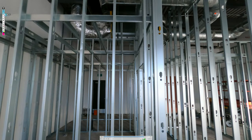So ceiling work is pretty standard. We're shooting our line laser and we're marking our elevations. We're putting our track. It's just like building a wall on its side. And I put two screws in every stud. I do two screws in every single stud. Even if it goes into a wall, I'm using 1 1/4 and I'm putting two in every one.